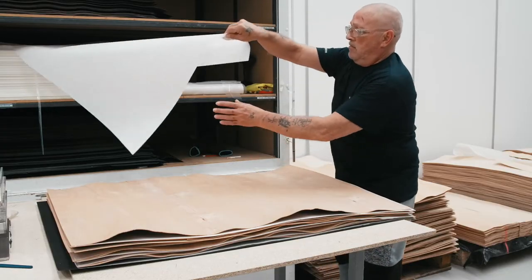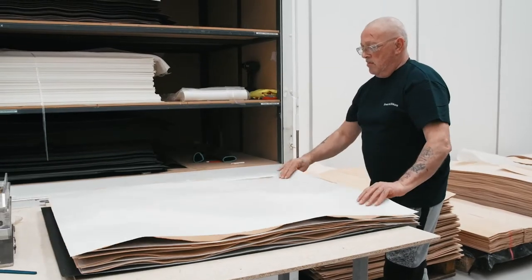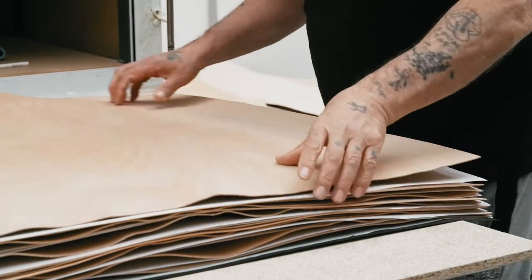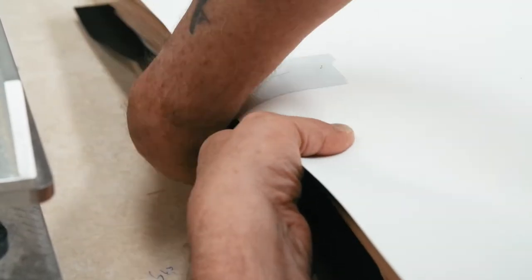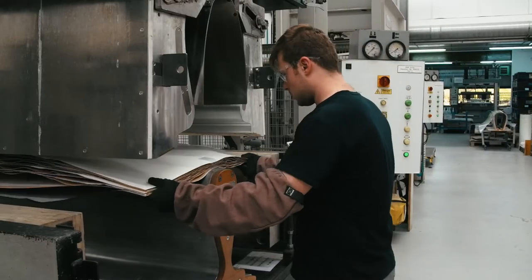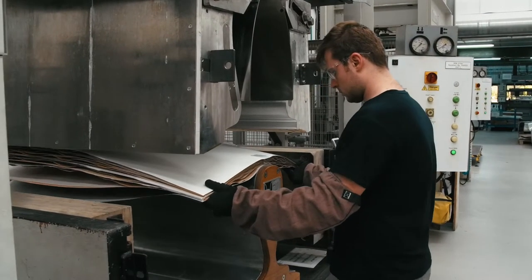Each layer of beech is separated by a layer of dry glue — it's a new process we've introduced for the latest generation of 800 series diamond. So it's layer of wood, layer of dry glue, layer of wood, layer of dry glue, and so on. All those layers of wood and glue and veneer go together and then we heat the whole thing and put it onto a forming press.